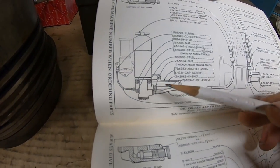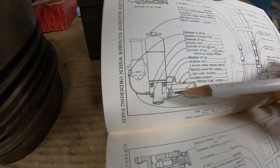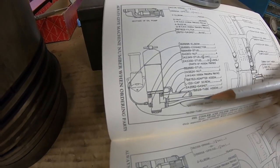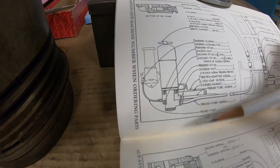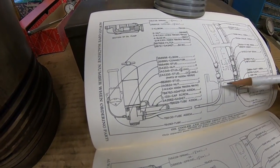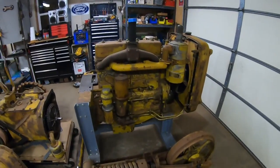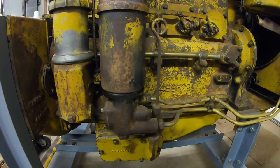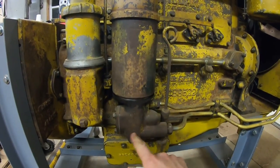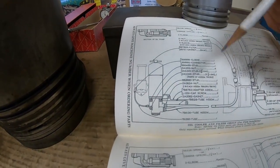In addition to that, it takes an entirely different oil filter setup — base, canister, cap, everything. And doubtless there's going to be a bypass down in here in case your cooler would get restricted or the lines would get kinked, that would allow that oil flow to bypass inside that filter base instead of backing up trying to get through a cooler or lines that are restricted. We went through all of that in the 1113 build — you can look back to the oil filter and base rebuild sequence, the episodes where I described the oil flow through this and the checks and bypasses in case of damage out toward the cooler. It's very likely a similar setup to what's in the RD6 and the D6 right here.